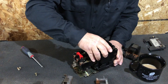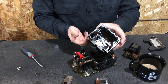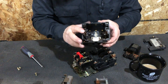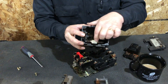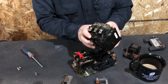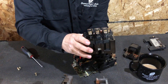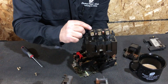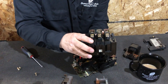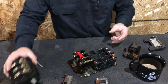Pull this head off here — this is the top section, held by two screws in the corners. When that hook pulls, it acts against this white plastic bushing. When that happens, on the inside of the starter it pushes these three sets of contacts — your A, B, and C phase. When they move, it bridges the gap and makes the connection from the top contact to the bottom contact inside the starter. It's electromechanical action pulling the contacts into place.